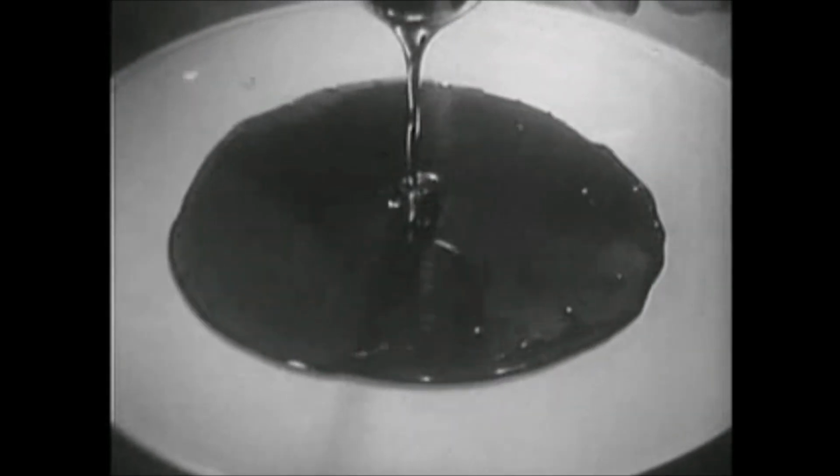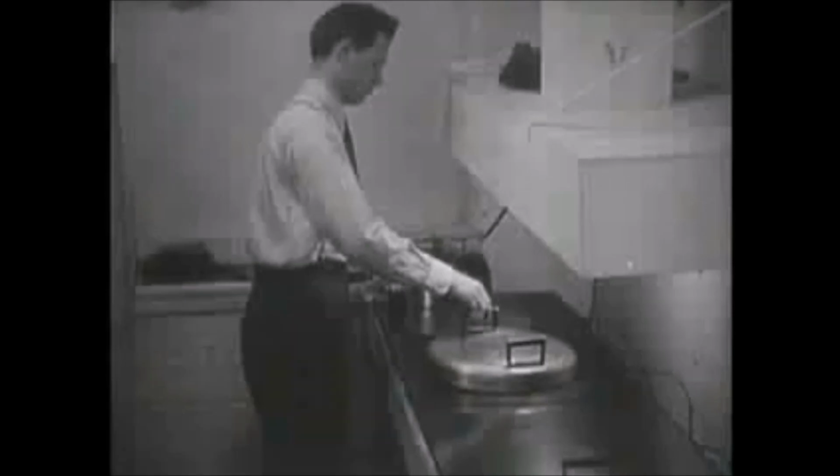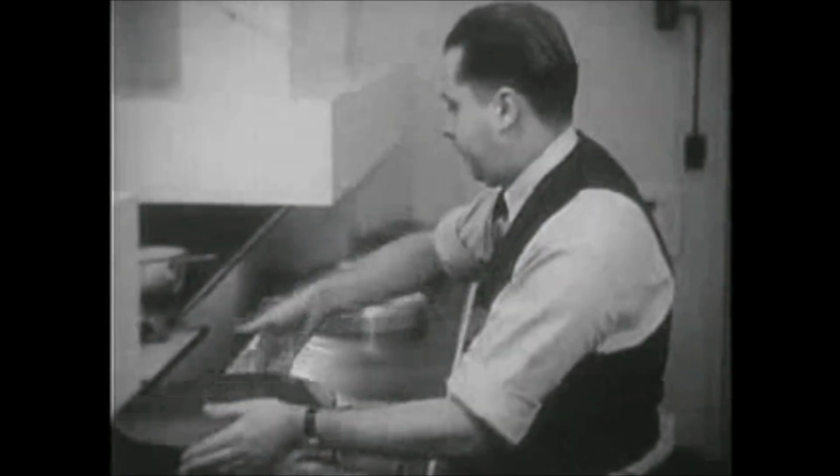The first step, I learned, is to pour a thin layer of molten wax onto a hot plate, the beginning of the master record. A hot flame melts all bubbles and flaws out of the wax, which is of the purest possible grade. This is done in a sealed, dust-proof, and air-conditioned room where the temperature is thermostatically controlled. A second going over with the flame, and the wax is ready for slow and careful cooling, almost ready for the recording of the music. Meticulous examination ensures smooth perfection before the wax is passed through a special slot to the recording room.